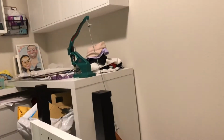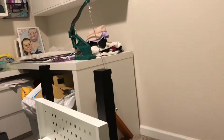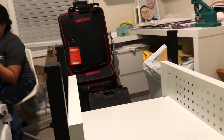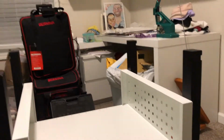And make sure you put the bolts from the inside, screwing them outward, because this is where the threading is here. So you can see that there. So make sure you get 2 bolts on each arm. Oh, and then I only hand tighten them so they're loose, because what you want to do is have some play when we get this tabletop up here. That way we can adjust everything, and then you tighten everything down after you get the tabletop on and in the place exactly where you want it. So let's go ahead and do that.